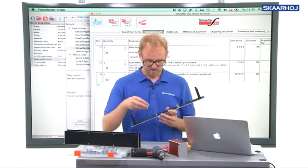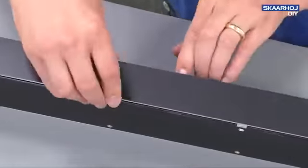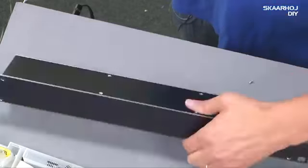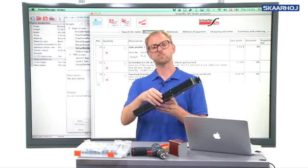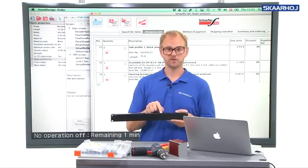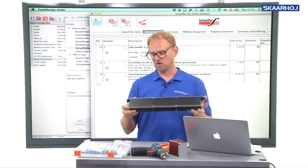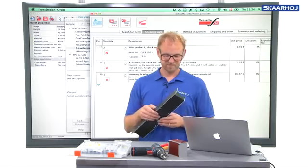But the point is that now that I have housing profiles there, and on the other side, and voila, there you got a nice 80 millimeter deep 1 unit rack enclosure based on Shefa side profiles. Black side profiles, black screw kit on the front, using housing brackets mounted on studs on the front to hide the screw holes. On the back we see screw holes. And all that is left to do now is to place cutouts for your buttons, printed circuit boards, or whatever you want here on the front. And on the back as well, of course.